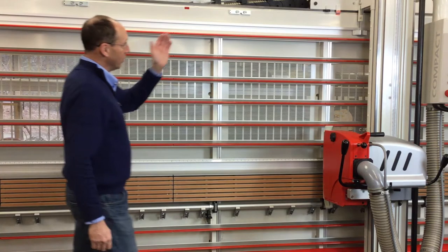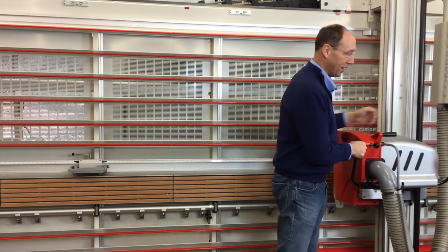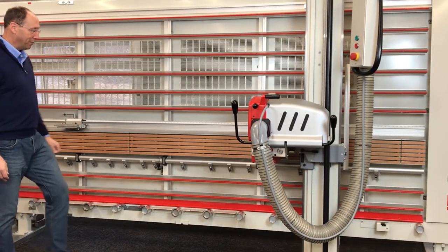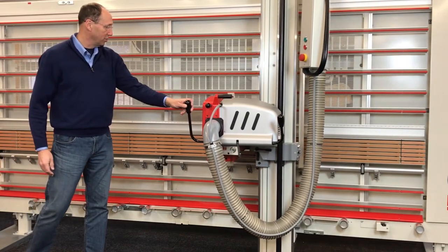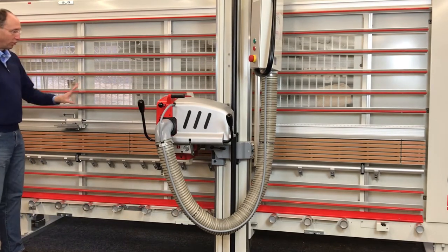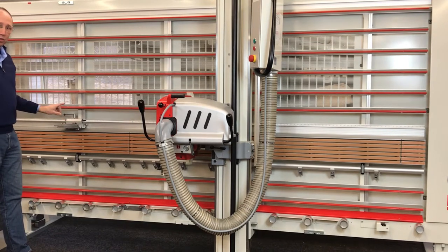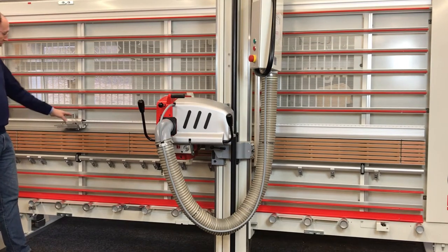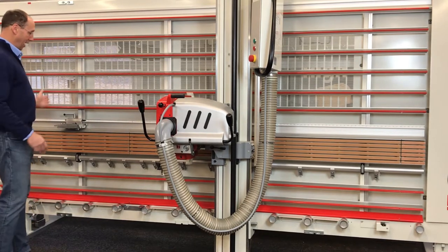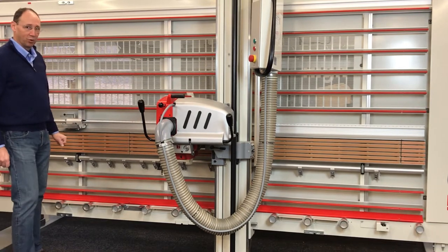On the small compact, I do have one more station down, which would be 80 inches added to my tape measure. If I have the optional digital measuring system, when I move the beam down I simply press a button and it will add 40 inches to the display. If I press it again, it will add 80 inches to the display, and I don't have to do the math that the tape measure pointer finger requires.